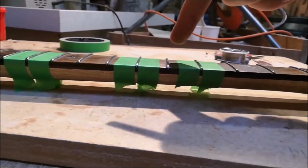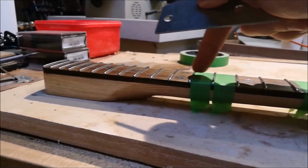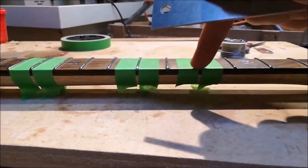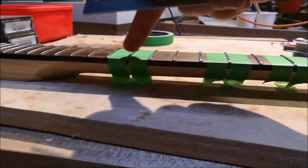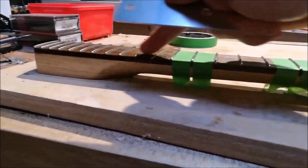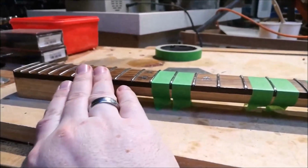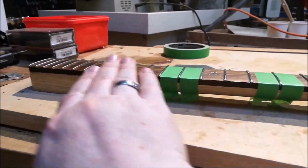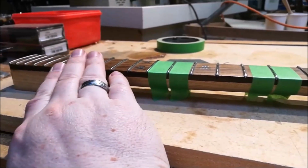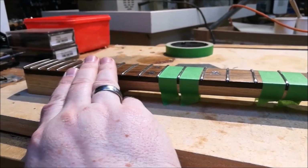So I've identified 3 frets below the 12th fret where that's a problem, and it's quite a frequent problem above the 12th fret. So I'm just going to spot level and then recrown and polish those frets, but I'm going to just gently, just slightly re-level all the frets above the 12th fret. Doesn't matter if that makes them slightly lower than these frets, because these are higher up the fretboard, so that won't cause any buzz. And then I'll re-crown all of those and polish them.